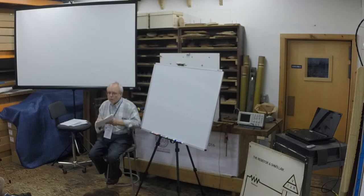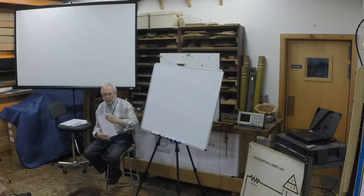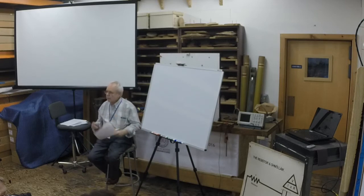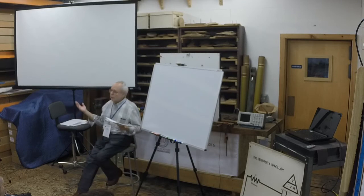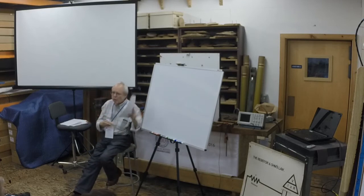Typically, in AC house wiring, it's done this way. That's a 20 amp circuit there. So it will require, I believe, 12 gauge wire to the circuit breaker. But you don't know how far the circuit breaker is away. So this is kind of a coarse estimate, but at least it should keep you out of the very deep water.